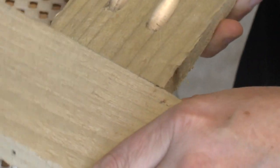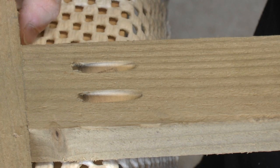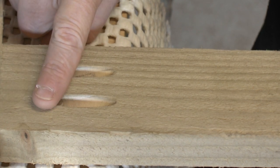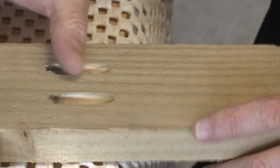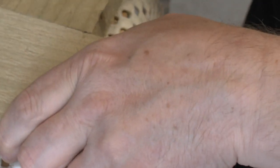But anyway, it only went through a little bit, but let's cut to the chase. That is one super tight joint. Now, I'm not saying that it would be as good as a regular mortise and tenon joint, but for a butt joint, that is incredibly strong, and you could also reinforce it by applying glue. And I know it's going into the end grain on this piece, but with the pocket hole screws really secure in some good meat of the timber here, not the end grain, but going in from the side, take it from me, that is not one ounce of wiggle in that. So, wow, yeah, super impressed.